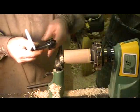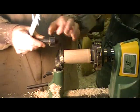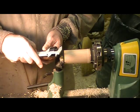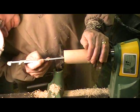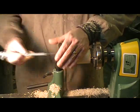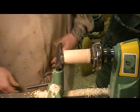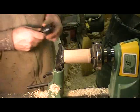So it needs to be deep enough. I want it to come all the way down to the end so that it's got this distance to keep it from getting skewed. Is 1 5/16. And I'm already 1 7/16, so I'm already deep enough. So I just need to open that hole up to be able to slide this in there.